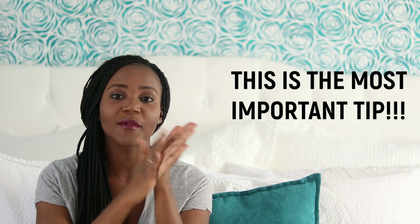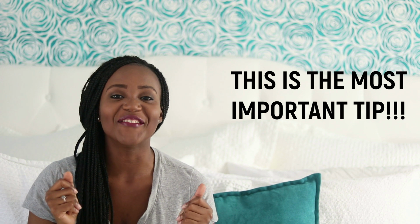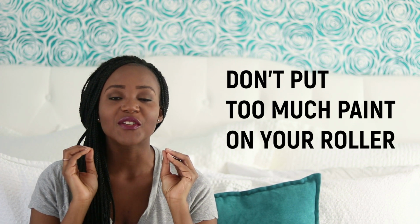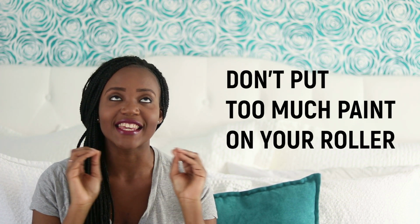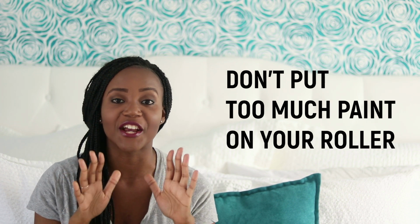And this is the most important tip, okay? This is the most important tip, okay? Listen up. Do not put too much paint on your roller. This is the most important thing. I'm so serious. If you take nothing else away from this video, take away this.